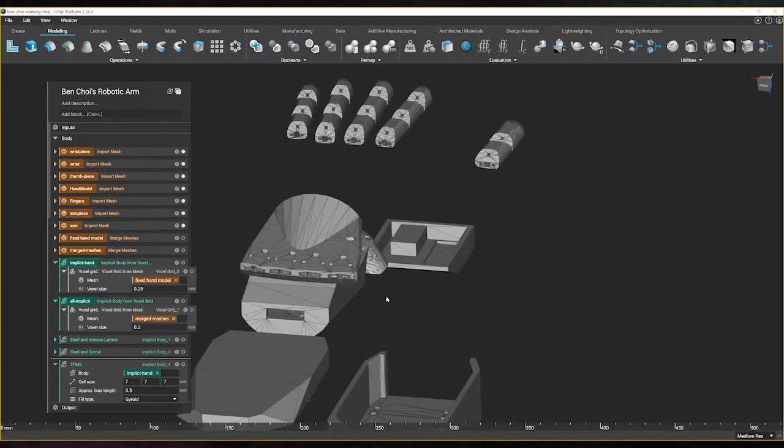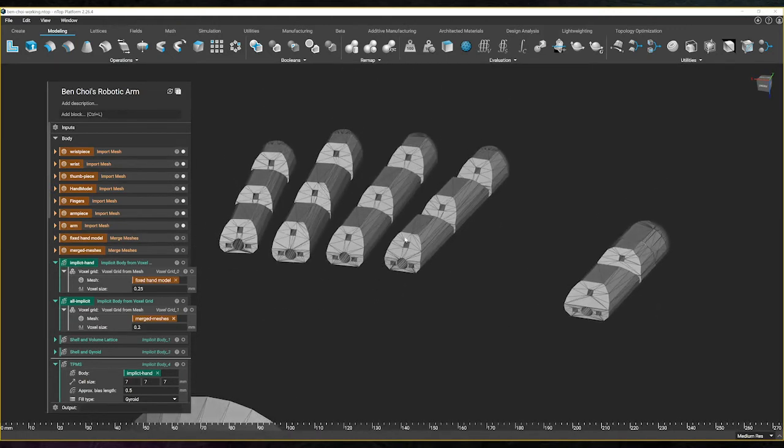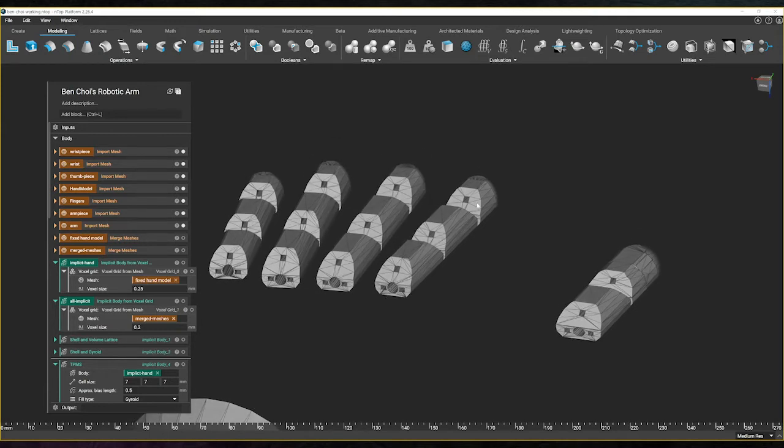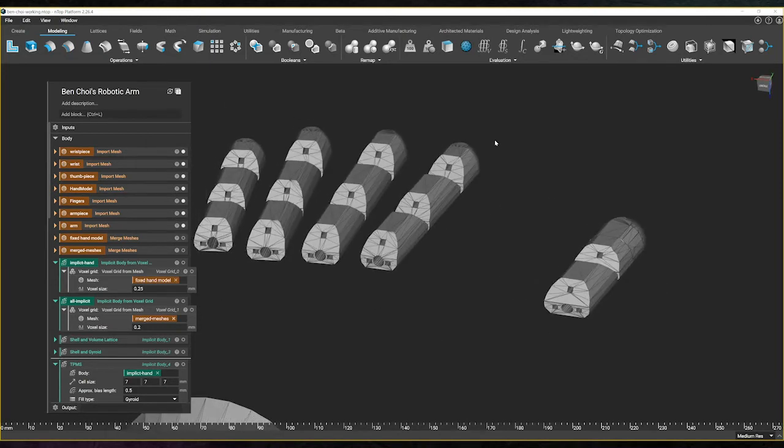We're not showing it fully in order here, and some of them are rearranged, but we've got, from the fingers all the way to the arms, the finger pieces here, and these have these through holes. What goes through these? Right now I have this plastic wire, and when tension is applied to that wire, the fingers can curl inward, so that provides the mechanism for the flexion and extension. Okay, awesome. So there's tension in this wire, and that's how it's gripping.